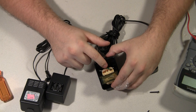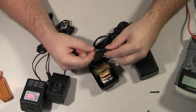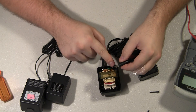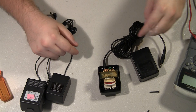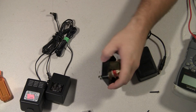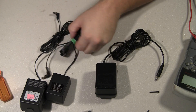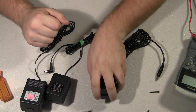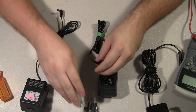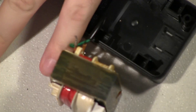On the NES one, there are two wires. The one with the green is probably the inside wire, and the bare copper is probably the ring. The inside — which we'll call the tip — will be the green wire. Of course, on the NES it doesn't matter. So you always have options. If you want to keep the original look of the NES but the cord is bad, you can steal a cord off of something else. If you just want a working AC adapter but it has the wrong tip, put on a new tip and you're good to go.